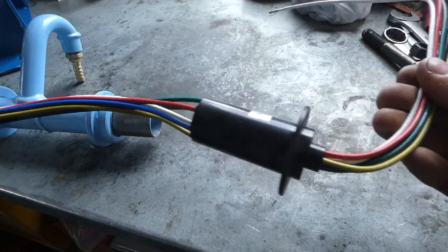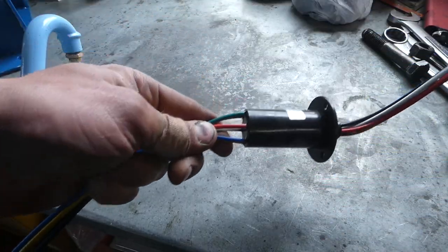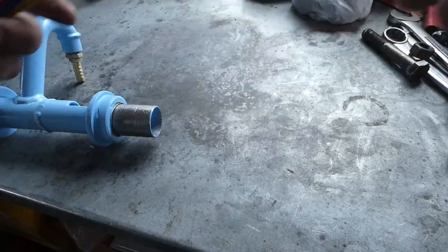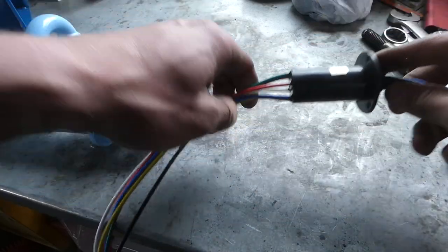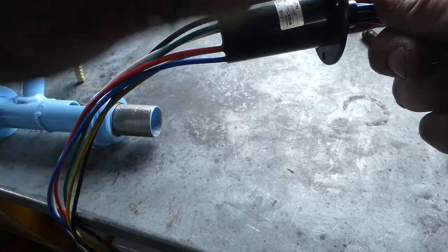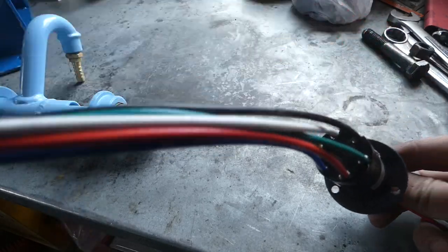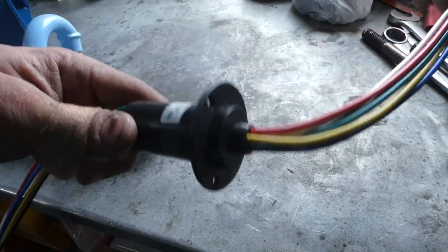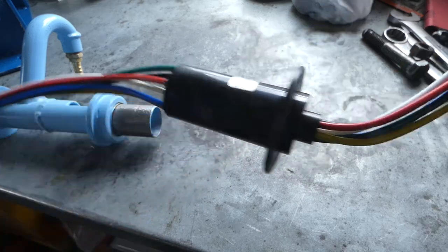You can see we've got six wires on one end, six wires on the other, but you'll notice as I turn this it can turn completely freely. Now if I just had a cable sticking out of this reel it would whip around and get all twisted up. But these slip rings have wires going to a set of contacts inside that brush up against the outer wall and transmit one leg to its corresponding output. So this is what's going to make the electric side of this reel work — they're called slip rings. Really neat.